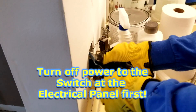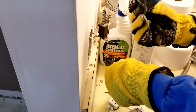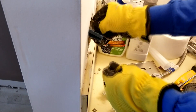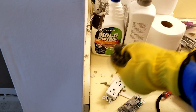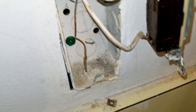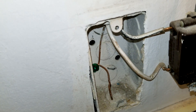So now let's show you the proper way to ground one of these boxes. We're going to have to clean this off first. I usually use this blue emery sandpaper tape — this is what plumbers use for doing a little abrasive sanding on the pipes before they solder. See how this is nice and shiny copper now? That's how you make a nice good conductor. You can see what we've done is we've wrapped the wire around a ground screw now. So this metal box is already bonded to the system ground.